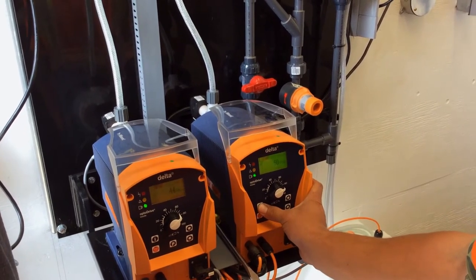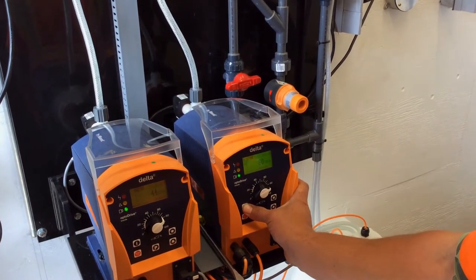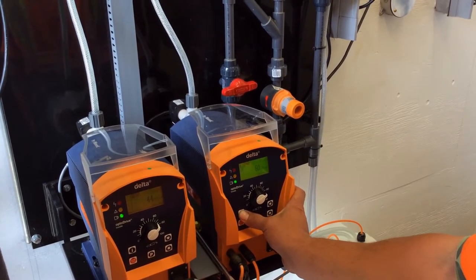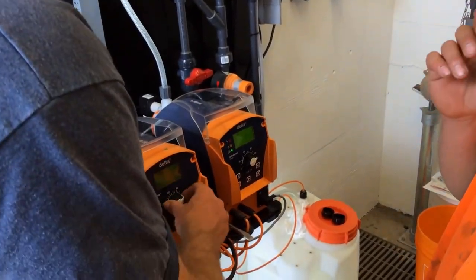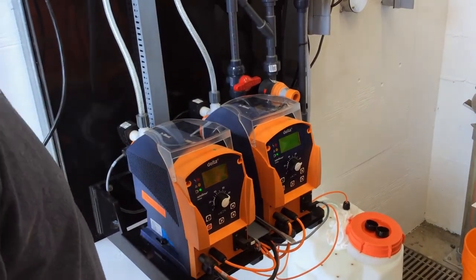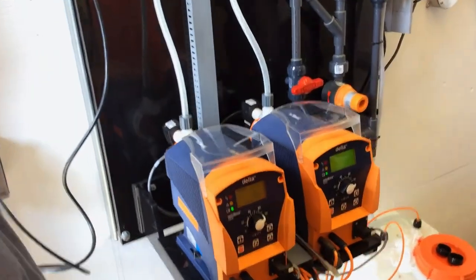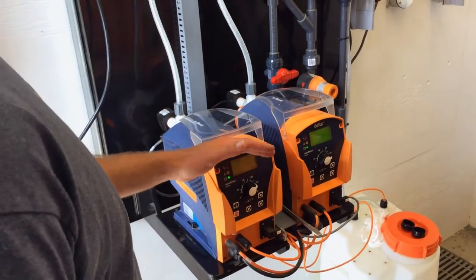Yep. So that's how many liters is pumped. That's this knob. It tells you some settings inside it: strokes per hour, strokes per minute, liters per hour, and so whichever one makes sense to you. I usually like the percent because I hate this dial right here. I much prefer going by the digital, so I usually leave it on percent. But pressing the I button as many times as you want won't ever do anything to the pump. It's just information. So this guy's calibrated.